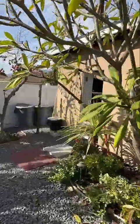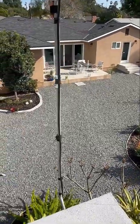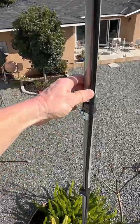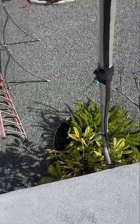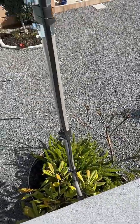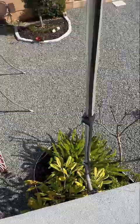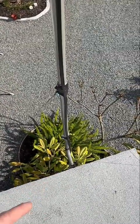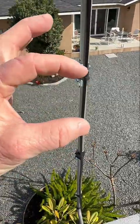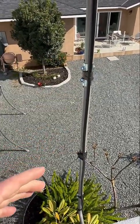I can still hit those repeaters. Here we are looking at the antenna. I have a link for this antenna support, and I also put some guy wires. It's attached with bolts to my fascia — I have a thick fascia though, so you might want to do some extra support. I have a pretty thick fascia board, not like the thinner fascia boards that a lot of people have.